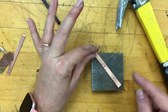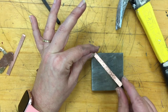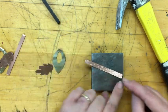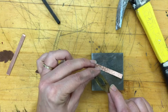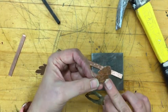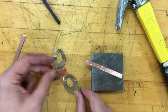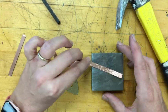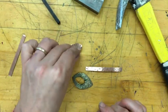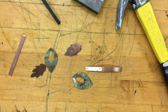At this point I've created a stamped texture on my surface — I wanted it to be heavier on the bottom and fade toward the top. You might notice that my metal has curved a little bit, and that happens when you do any kind of hammering on the surface of metal. To get your metal to curve back to the position you want, flip it with the curved side up so it's curving towards you, then get a wooden or rubber mallet and hammer it back flat on a wooden surface.